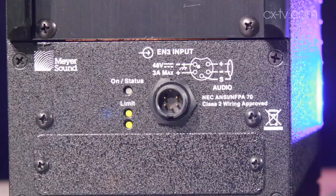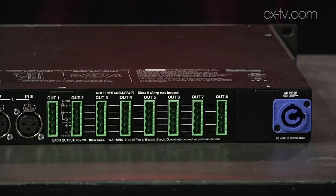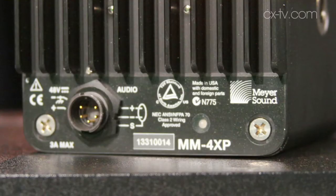Now there are a couple of different output cabling options. We've got the EN3 connectors, which are basically a locking, almost bayonet-style lock. Or you can get Phoenix connectors, and you can get those options on both the speaker cabinets and on the power supply. So you can go Phoenix or EN3 or a mixture, depending on what your application is. The thing I like about the EN3 is they lock. The thing I like about the Phoenix is it's much easier to field terminate — you just screw it in, you need one screwdriver and you're done.